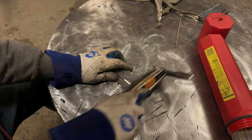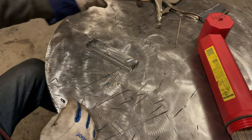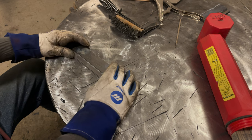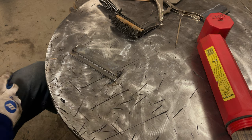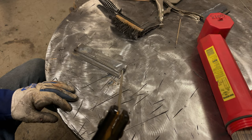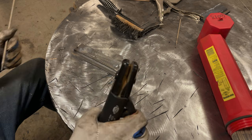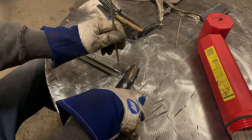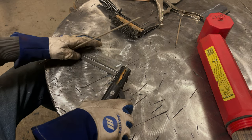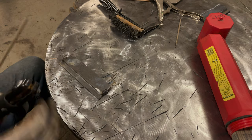So I'm welding much the same as if you got an old tombstone or very simple welder. One of the hardest things with stick welding is to be comfortable or get the proper alignment. Now, because of this camera over here to my right, it's going to be very difficult for me to carry this rod and stinger and not have the plate interfere with it as I flatten out. It's going to want to change my rod angle to straight up and down, and I definitely don't want that. So I'm going to slightly reposition the camera, and I'm just going to bring this out closer to the edge.